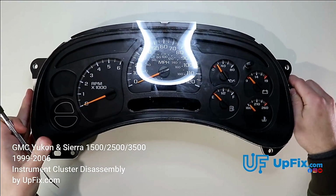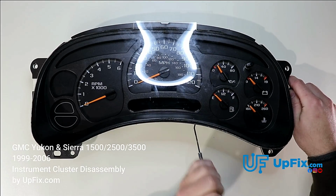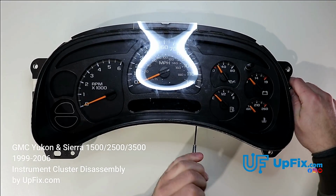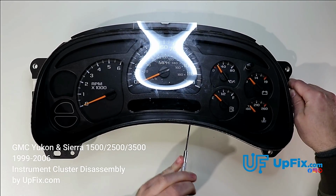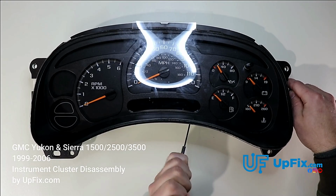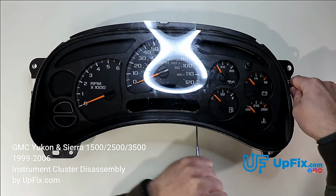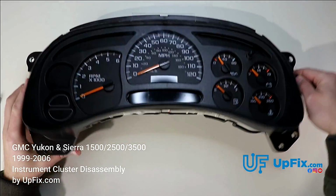So as I'm prying the board up, I'm going to insert the clip inside here. And now I'm inside on one corner. And basically, you're just massaging it out. If it doesn't come out right away, try the other side. Try not to stab it too much, because the more you stab it, the more it might drive itself in there and it won't come out. So basically I got one tab freed up, and let me show you what that tab looks like.